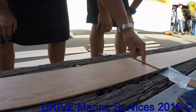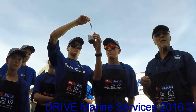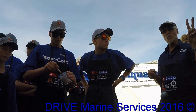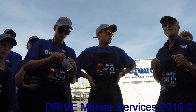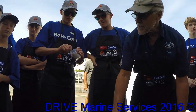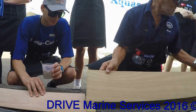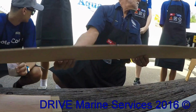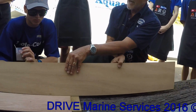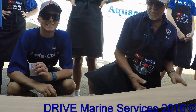All right. Now we're going to do a demo on yours. Nice. Oh, that's beautiful. You want it like that. Now, how many resin did he use? 2. How many hardener? 1. But he's got a double mix, so he's got 4 resin, 2 hardener. Okay, so now we're using a top panel. You all happy with that? Look how this is the top of the top panel, and I know that because of the angle down like that. We all happy with that? Right, so slide it out.